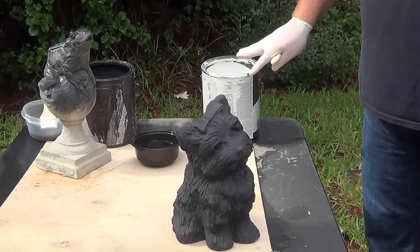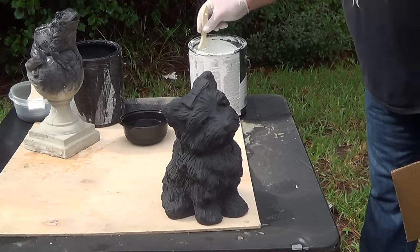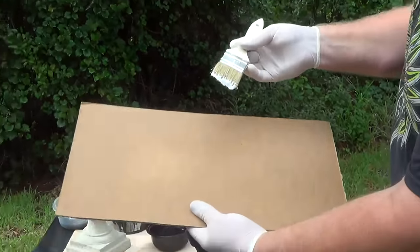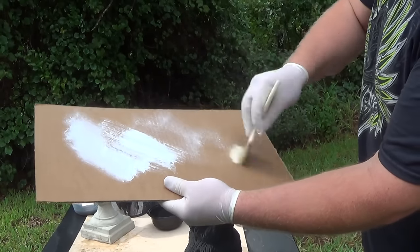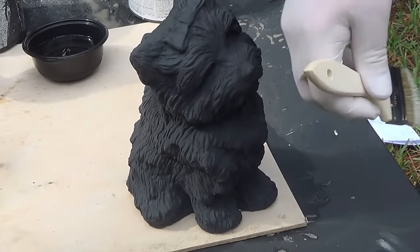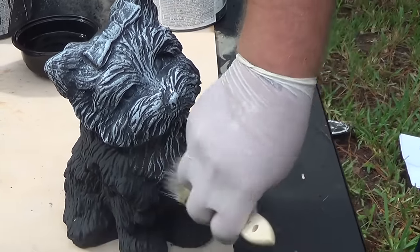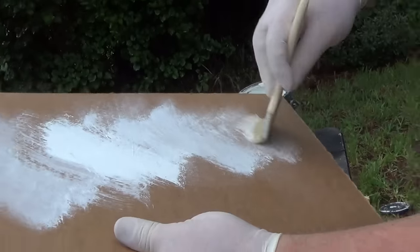It's with a technique called dry brushing, used a lot in ceramics and hobby painting — the same technique used here just on a larger scale. Again, acrylic latex paint — this is flat white acrylic latex. I don't like using gloss or satin paints because they smear more. Flat paint is where it's at. You dip your brush just a little bit into the paint — just a little bit, you don't want to dunk the whole thing in. Then you get yourself a piece of cardboard and go back and forth, wiping most of that paint off to where there's next to nothing on there. Then you go to your concrete piece and do a dusting motion — just go back and forth like you're dusting it.